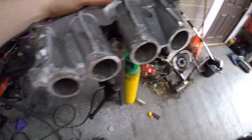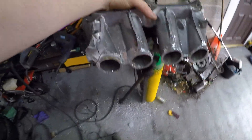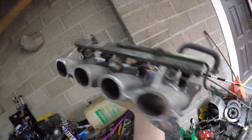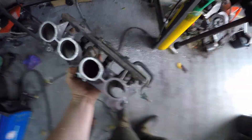So what I've been doing now is — there's a lot of aluminium shavings down there — I've been trimming around these areas, getting it to a nice shape. I've been notching at these bits, getting rid of some of these webbings. I'm keeping these webbings though, as they'll be good for strength. On the top half I'll do a little web there as well, and I'll take off this big clump of metal here. Then I'll be able to see how far off we are with our plate.